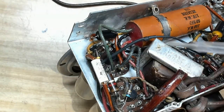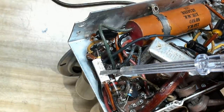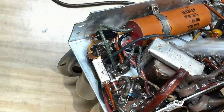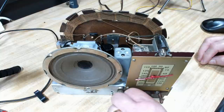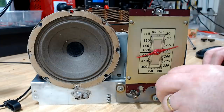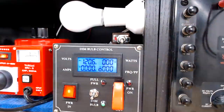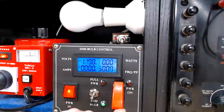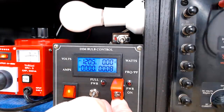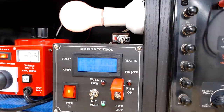I've soldered the new capacitor in and wired it up, so we're ready to go with that. I got a delivery of the across-the-line X-caps and fitted one. I can't see any reason why we can't try powering this up now. I've got my power supply on dim bulb with an isolation transformer set to 120 volts roughly. Let's see what happens — keep your eye on the bulb. That looks pretty good — it came on bright and is dimming off. There's a very dim light in the dial bulb that should come up hopefully. We've got 91 volts on there.